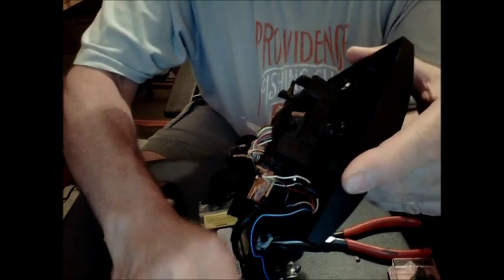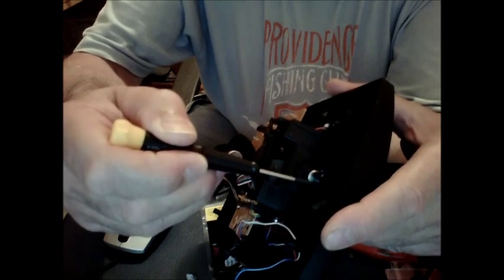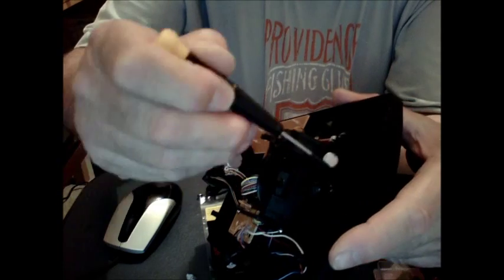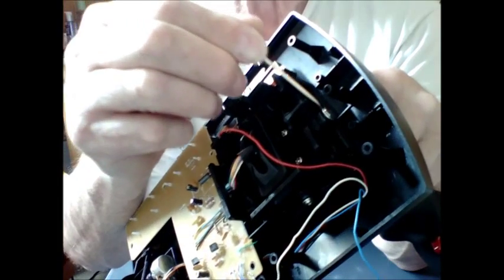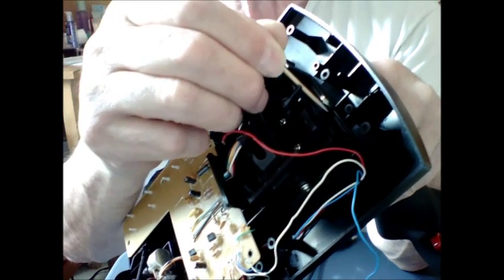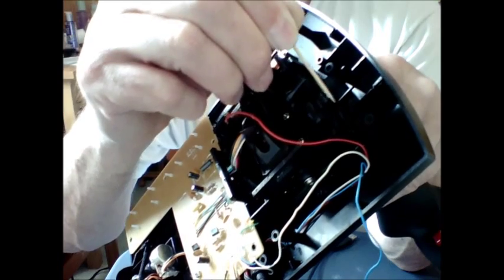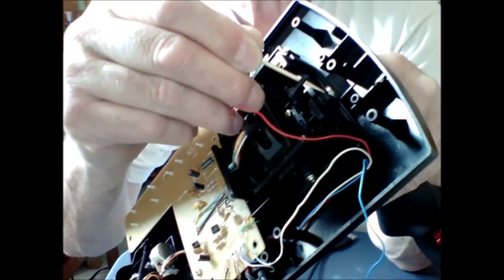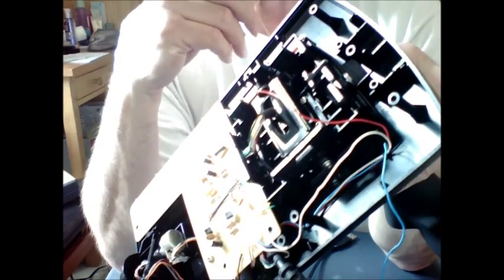While you've got it out, you may as well mount this into the axis. Push it down firmly and align it so that the dot is across this direction — so you've got the neutral point pointing outwards towards where the sensor will be. I now have the magnet mounted in that axis. I've left a 2mm gap between the bottom of the magnet and the plastic. That is so that the magnet sits out far enough to be sitting under the sensor head when we mount that, and that's what we're going to look at next.